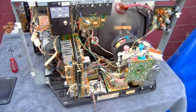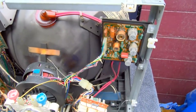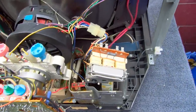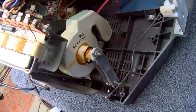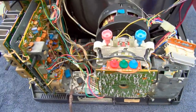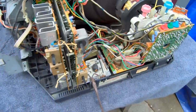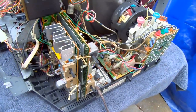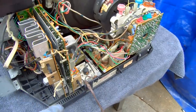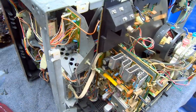You can have a look at the inside of this beauty — not many of these left around. I don't think GE had a reputation for longevity. The flyback is back here. We have one big filter capacitor back here. I'm interested in checking the capacitors down here on this board — there's a bunch of them. Really, those on that power board. We've got the big one in there and then we've got some here.